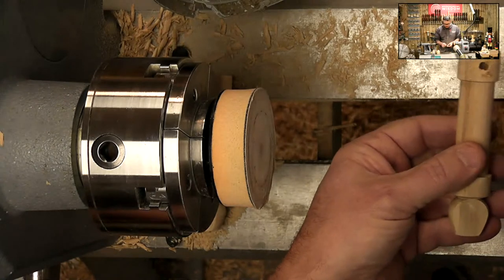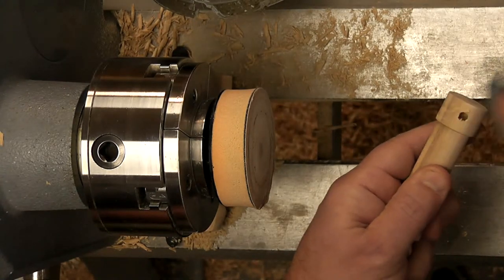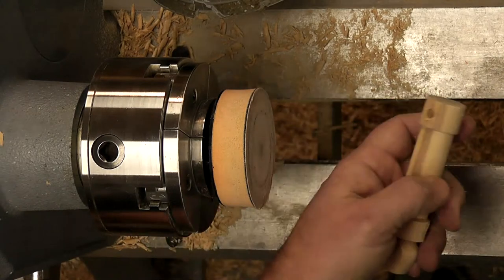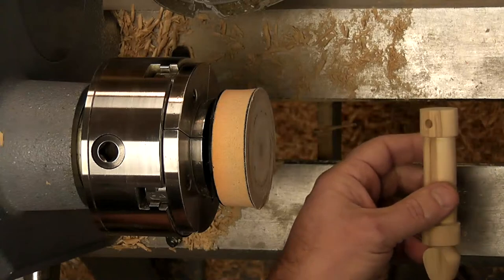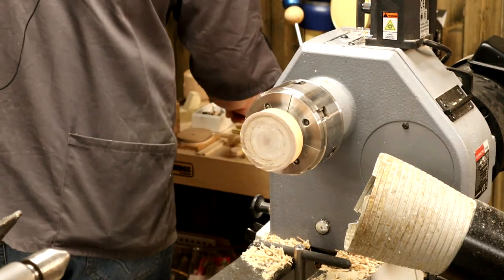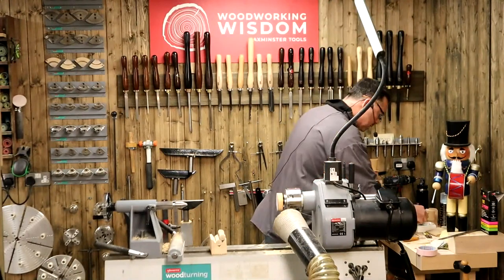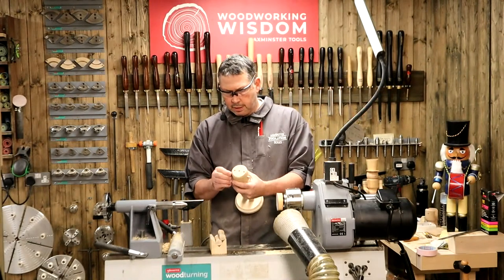So again, just a little bit of burr. Lip and spur on everything that we're using here. Don't be tempted to use a twist drill. Twist drills will just skid everywhere. They won't produce a very good hole at all. So let's quickly, and I keep using that word quickly, only because I know we have an hour to do this, put some little dowels in, off camera, ready to take the arms.